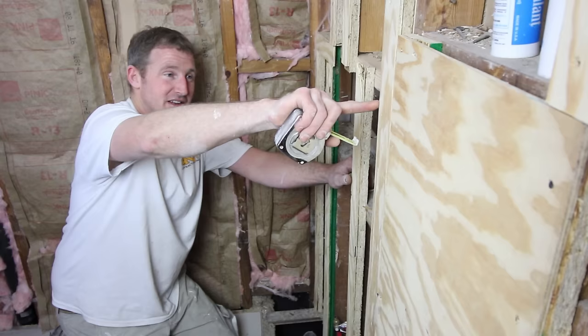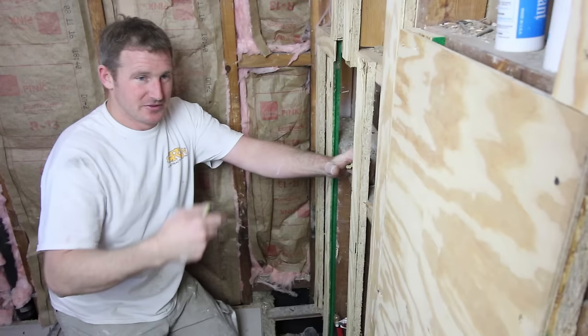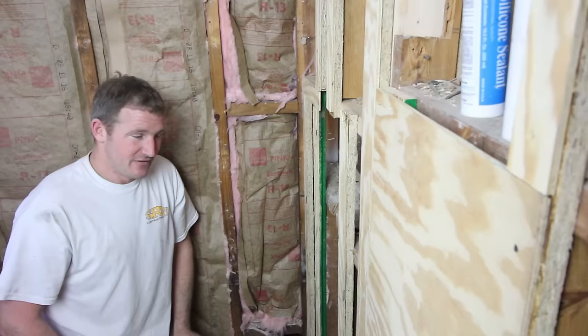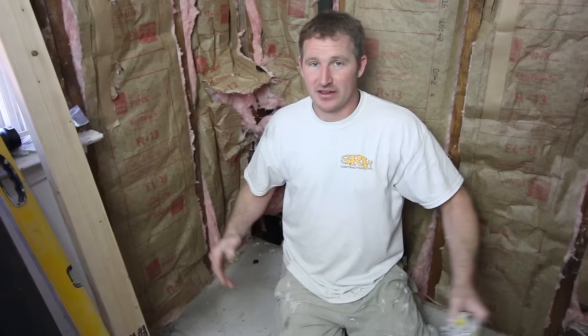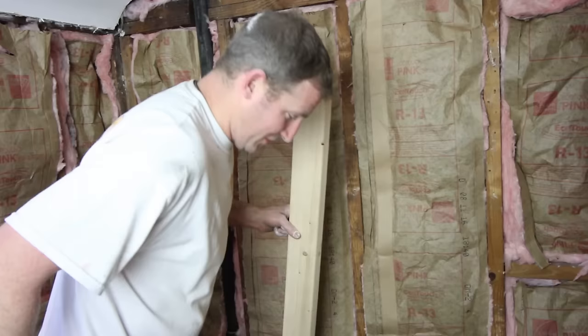What we have here is three-quarters of an inch, and then we have quarter-inch plywood on top of that. I just bought sheets of plywood, ripped them down, and basically nailed them into the studs — so right now we have a one-inch filler. Once we put in the tub, we're going to use some shims to make up that extra quarter inch we need to be level. Since we already have existing plaster on this side at three-quarters of an inch, once we get that quarter-inch shim and the backer board, it'll be flush with the plaster.